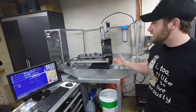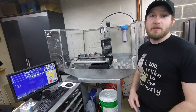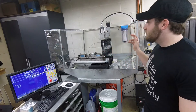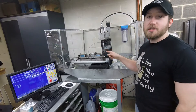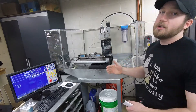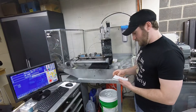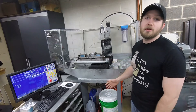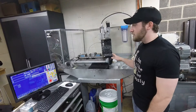Besides that, it's got a big Kurt — a DL430 dual-head vise with a set of four-inch Carve Smarts on it as well. I'm also running a Renishaw TS27R tool setter and an LP2 probe for my probing, tool setting, and offset setup. The whole machine is running on Hiwin linear rails — got rid of all the dovetails, didn't want to deal with any of the issues I was having with those.